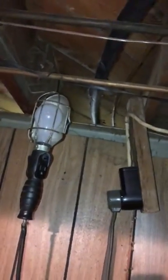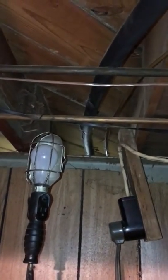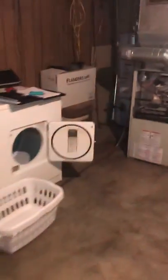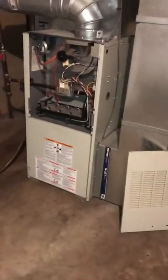I'm having trouble tracking where that line set is going — oh, here it is. I'm going to recommend we flush it and not go through the hassle of trying to route it through the ceiling space. Not sure whether these tiles lift. Looks like it's about a 25–30 foot distance to get outside, so I'm going to recommend flushing that. It looks in good shape.